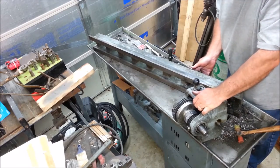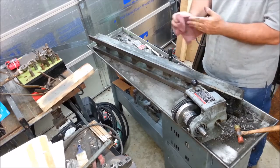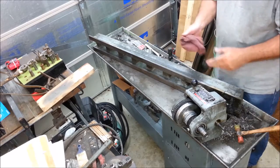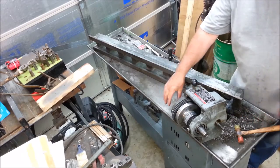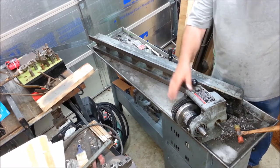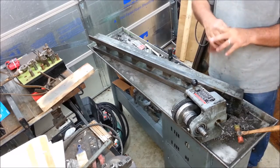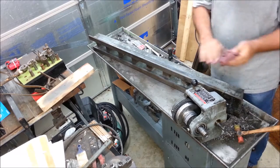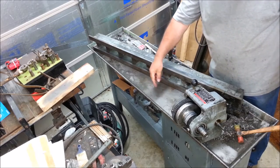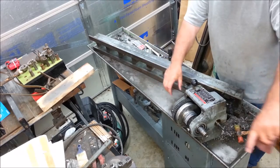There we go. I'm really going to come back to this tomorrow. I might have to make a tool to draw the spindle out of here — I've loosened all the set screws and the spindle's still stuck. But that'll be a tool I can use for other lathe work. I'll probably make a tube with a washer, a piece of all-thread that goes all the way through, and a nut to turn to pull the spindle out.